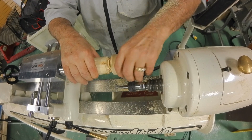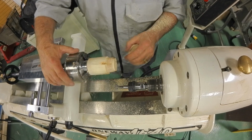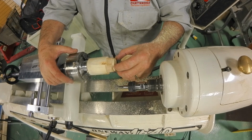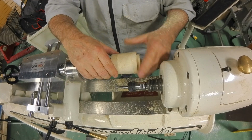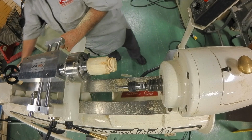It's just starting on. So we've got to make another cut. And my cutter hasn't touched the shoulder yet. So I knew before I went with this, it's not going to go. But I wanted to see how close it was and get about half a thread. So it's going to be a nice tight fit.